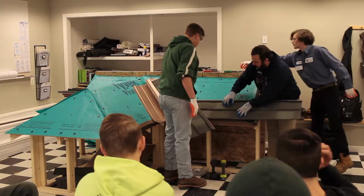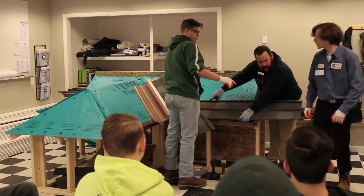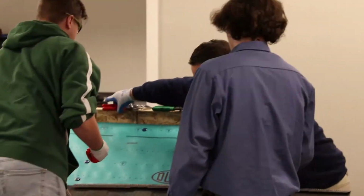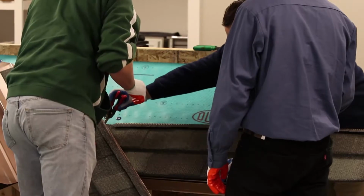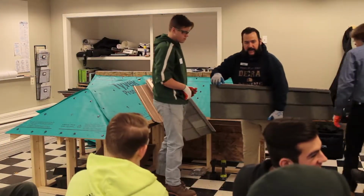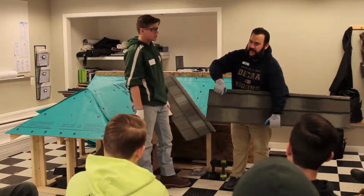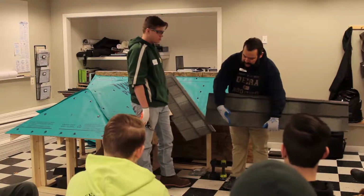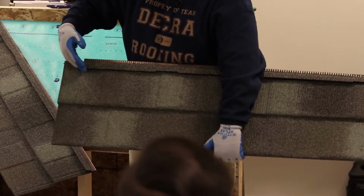And now we can go ahead and just scribe a line right down on top and just kind of try to chalk up the chip that's on there. I like to just take an old screwdriver or something and just do something like that if you want to just slide over. So you'll see here what we did to make our mark. And again, that's why I'll just use like a 16D nail or a screwdriver, just something to etch into there, because a pencil is not going to take, you won't be able to see it very well.